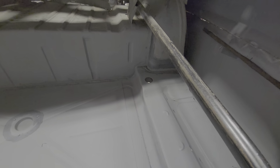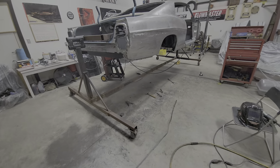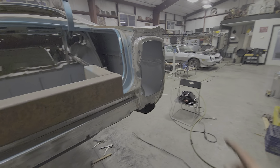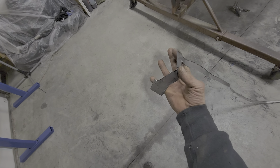What we ended up with on the inside is this strip, because you've overlapped your metal. I'm going to pull it out and show you guys. Here it is — it's roughly eight feet long, the same length as that quarter panel. As we welded I was cutting, cutting, cutting, and that strip becomes loose. I was able to just pull it right out the back end here. You'll see the back corner and everything where I cut that.